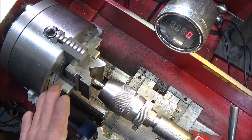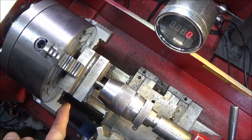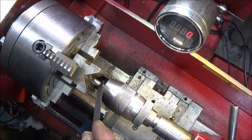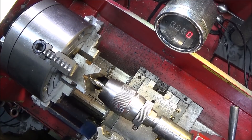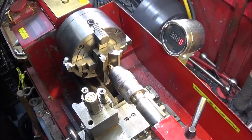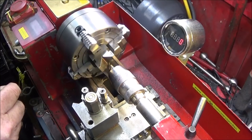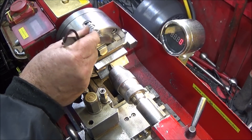On the Chinese mini lathe I'm using my four-jaw independent chuck and I've put the V-block in that chuck — two jaws going one way and the other two going the other way. I've brought the centre drill in; it's just a little bit smaller than the actual groove in the V-block. I've locked up the tailstock and I can sight down from the top through the groove to see that it's going to drill dead centre. If not, you can move the jaws either way until you get it dead right. On this one I'm having it dead centre in the groove but offset the other way, so the drilled hole will be towards one side — that gives much more room for the actual clamp to go on there.